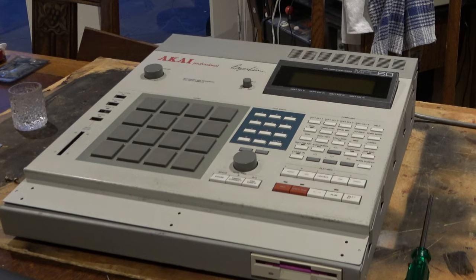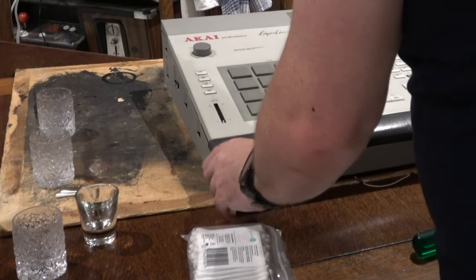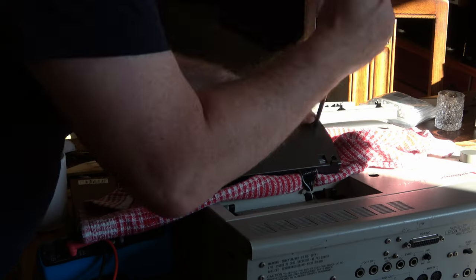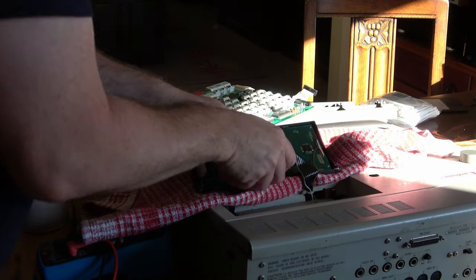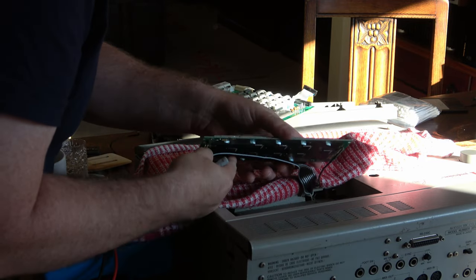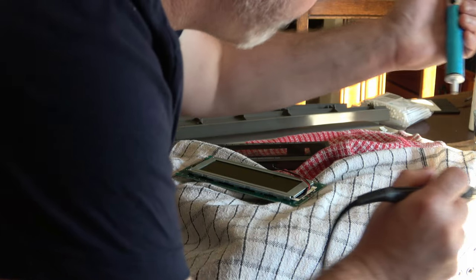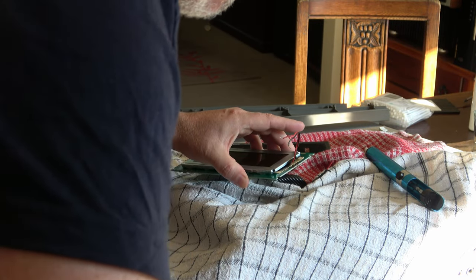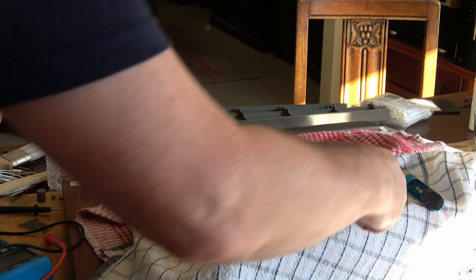A quick look at how it's coming together and I think it's starting to look so much better than it did. The next part is to actually get the bolster back on the front, and then we'll take a look at the backlight in the screen. The backlight is just a normal electroluminescent panel — the inverter required to run that backlight is still in good functional condition, so I'm just going to replace the backlight for the moment. You can buy reproduction LCD screens and they look really great — modern, with a lot higher contrast and a lot brighter — but we're doing this on a budget, so I'll just replace it with a new EL panel.